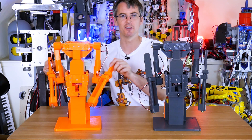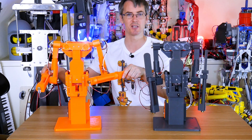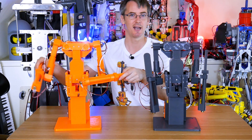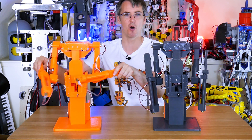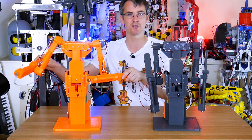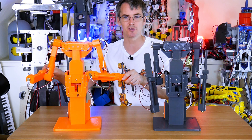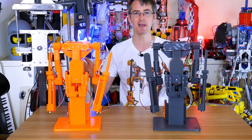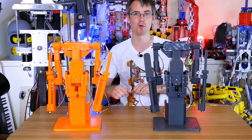I've made two of them - one grey and one orange - because we've got two big robots. That means we can have two puppeteering rigs and two operators. Perhaps people can do challenges where they have to use the robots to stack up blocks or spread peanut butter on toast. The next thing we need to do is map all of those pot values to DMX values and get those scaled to operate the robots.